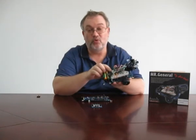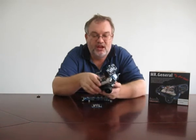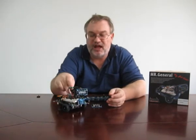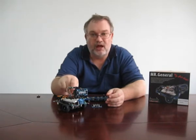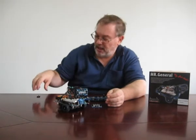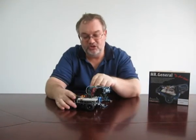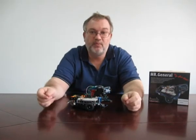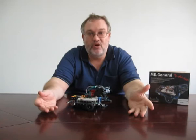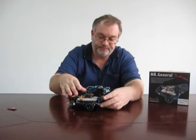We have a breadboard. We use the breadboard so that we can plug in any processor we want and wire it up however we want. The kit is currently supplied with an Arduino Atmega 8. This can be programmed with the Arduino IDE and this USB interface. Basically, you plug in your USB interface into the breadboard, plug in your cable, use the Arduino IDE to upload your software, and you're good to go.